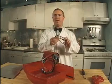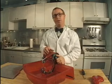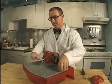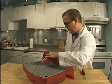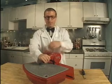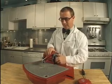When installing a Mega Blade into the saw, you won't be able to follow our golden rule of rotating the entire assembly by hand at first, but I'll show you a trick. Make sure your saw is filled with water. Reinstall your work surface so that you don't get wet. Reinstall the door. Hold the door shut with your hand and bump the switch a couple of times. Now when you remove the door, you'll be able to rotate the entire assembly freely and make sure all parts are moving.